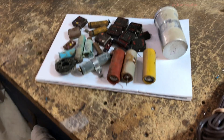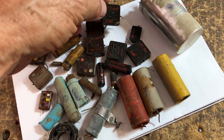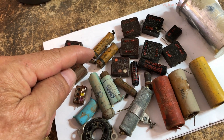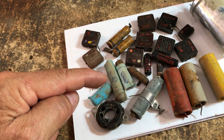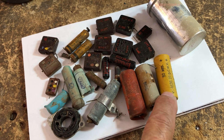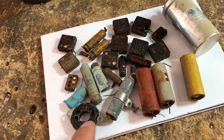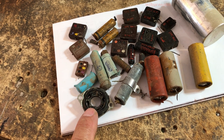Here's all the guts that came out of it. When you encounter these, they've got to go — they're paper. They're not micas or anything like that. They are paper caps; those are original caps. I believe these here were replaced caps, whenever they went in and did those. Here is your line-to-ground chassis. See, here's that old 5AZ4 socket that broke apart and then I had to replace.